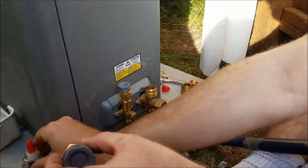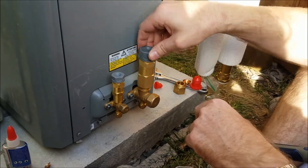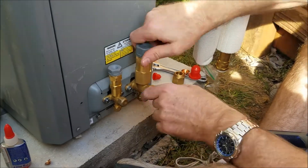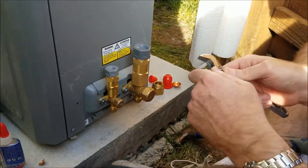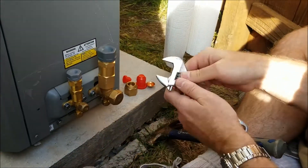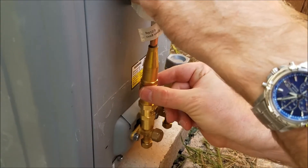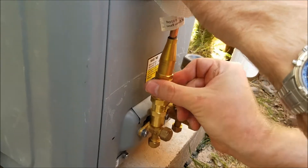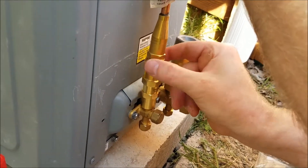The Nylog is almost like snot — that's probably the best term I can use for it — but it gives you that good seal. Once you have that sealed up, put the adapter on, and then it'll be the same thing on the other end of the adapter, and then you screw in the line set. The adapter lets you use the line set instead of having to flare your own copper and evacuate the system. This is what makes the system so great — it allows you to do all this yourself without needing an HVAC tech.